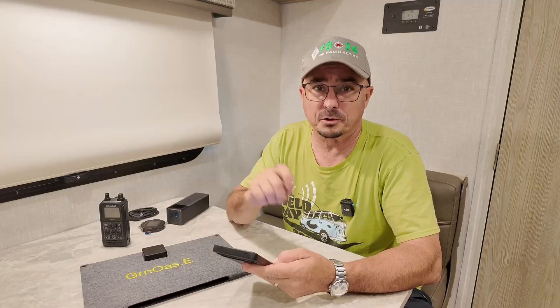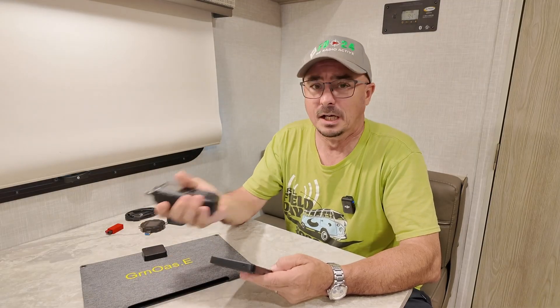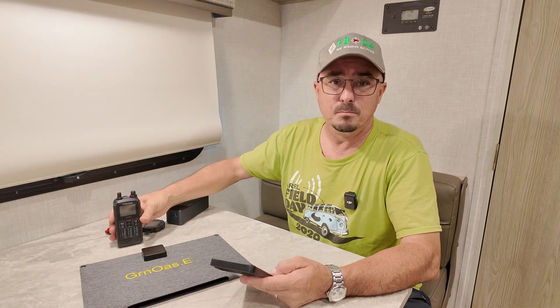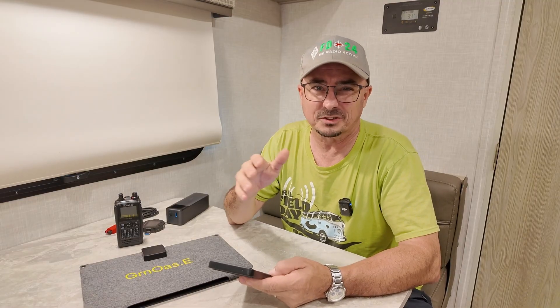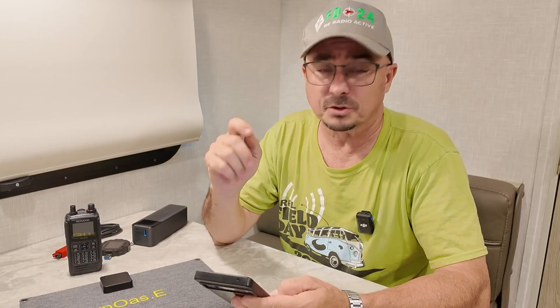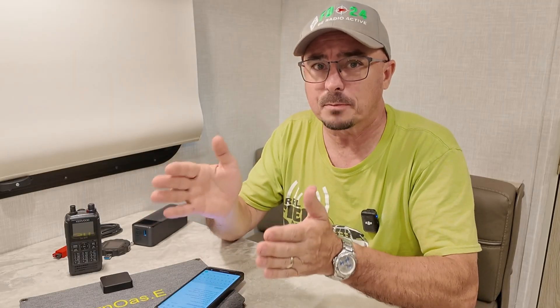I wanted to go a little bit further and run an honest real-world test recharging a radio from completely dead. I ran the standard battery that comes with the D75 completely dead. Starting in the morning — I didn't wait long into the day, so I might have squeezed this down to a shorter recharge time if I'd waited until the sun was really up. I chose to start right as the sun came over the horizon. Also keep in mind that with any battery technology, the first 70 to 80 percent of the charge goes pretty fast; that last 20 to 30 percent takes quite a bit longer. I used 12 volts for this test because I knew that would give me the best possible numbers.